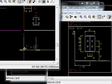Let's do that again. If you take the corner of the concrete and come 1'8" to the center of the column, then you come 8 inches to the face of the column, and then you go 4 inches and then 2 inches on either side. So there's 4 inches between these two bolts. I hope that makes sense and doesn't drive you crazy.